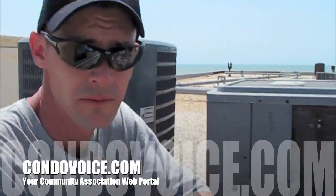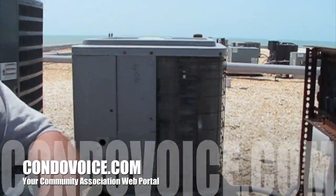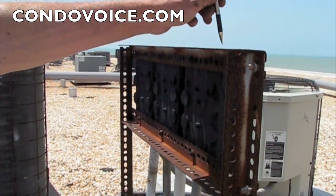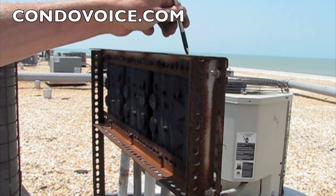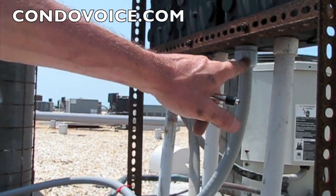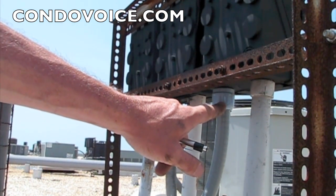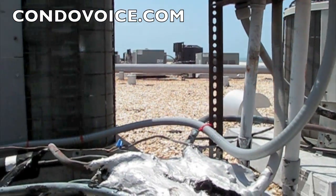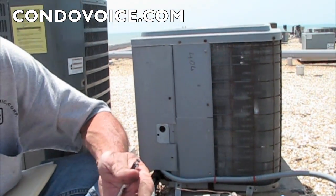Alright, so Tom, we've got to replace a whip. Tell me what a whip is and show me what you did here. A whip is coming out of the load side of the disconnect out to the air conditioning unit. This is a disconnect — a means of disconnect — for service of the unit if there's any problems up here for an AC or an electrical technician. They come up here and they're able to disconnect the unit without going down into the unit below and turning off the breaker. The problem was coming out of the bottom of the disconnect — a lot of the connectors were broken, destroyed, and rusted and no longer any good. So we replaced this line coming out and over to the unit, making sure that there are good connectors, the right size wire, and both connectors are properly fastened and secured in place.